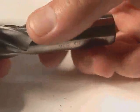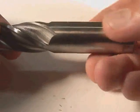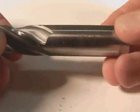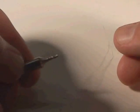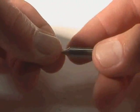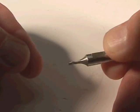The shank of this end mill happens to be the same diameter as the tool itself, which is three quarters of an inch. But sometimes the shank diameter does not match the diameter of the end mill. Here is its baby brother — same exact type of tool, but only one sixteenth of an inch in diameter. The shank is a quarter of an inch, so it is a much bigger shank than the end mill itself. This can be used to do engraving or fine detailed work.